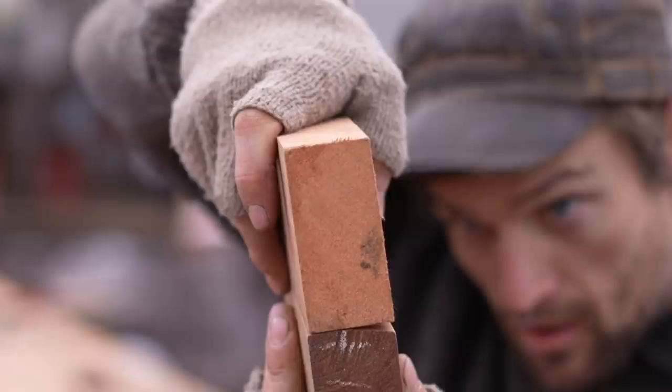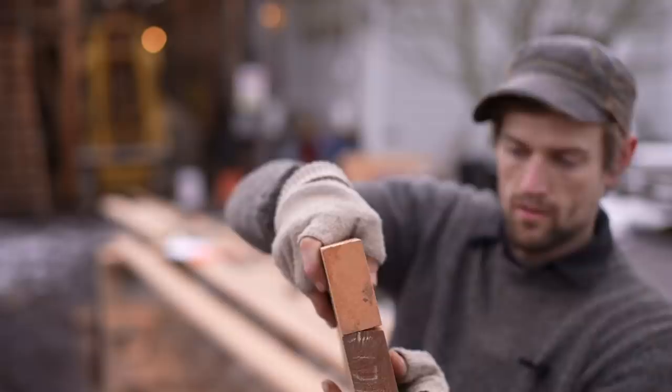And in that wedge-shaped crack, we'll pack our cotton and oakum, and that'll get oiled cotton put in, painted, bottom paint on the bottom seams, some white topside paint on the top seams, and then it'll get paid with seam compound of some sort. There are various different concoctions that people use.